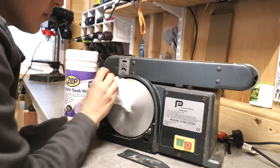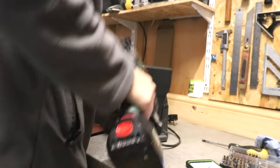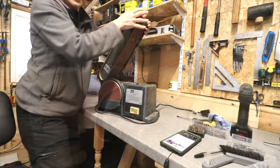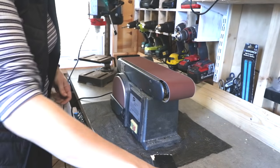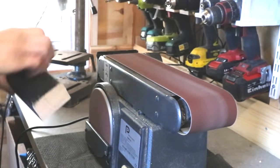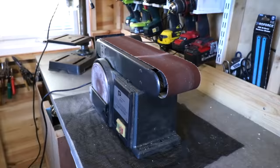Let's fast forward. I bought a self-adhesive sanding disc for it. Thank you, YouTube. I want to make sure the arrows inside are facing the right direction — I had to correct mine later — and adjust the tracking knob while it's spinning to stop it from slipping. I think that's going to be useful.